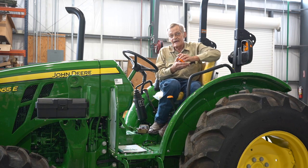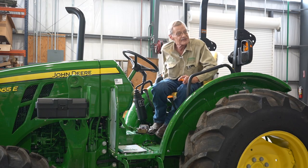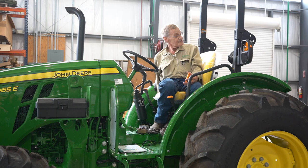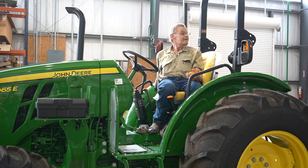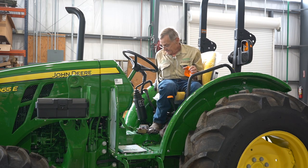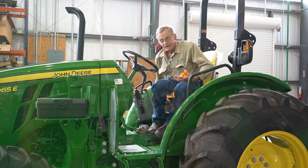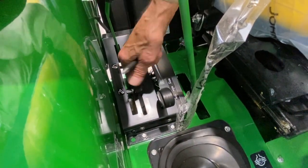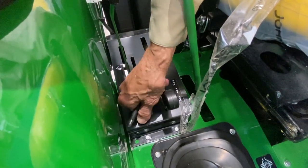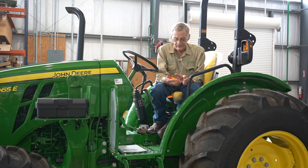The final issue is that the three-point won't go all the way down. I've got the lever as far forward as I can force it, but it's not far enough down. This is covered in the operator's manual — not in the mini tech manual, but in the operator's manual — concerning your controls. There's a small adjusting knob with a stop; you just loosen that up, move it forward, try it once again, and you'll note that the three-point lever goes all the way down and the rock shaft goes all the way down.